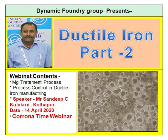Sometimes it is better to increase covering when you are getting less recovery of magnesium alloy, maybe because of an issue in the magnesium, or because of your higher temperature, or because of your higher sulfur, whatever reasons are there. When you are getting low recovery, it is always preferred or recommended to increase your covering scrap, so that the magnesium treatment will get a little bit of delay and you will get better recovery of the magnesium alloy.